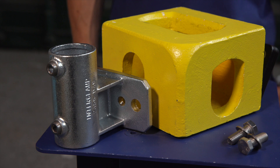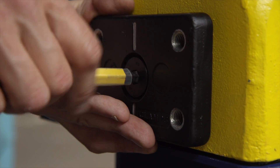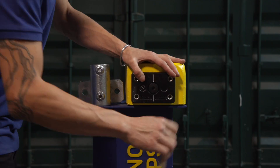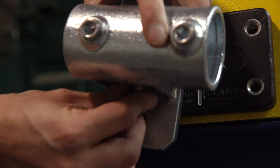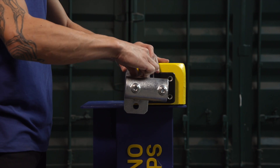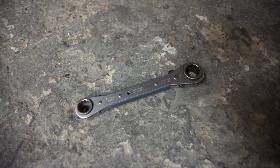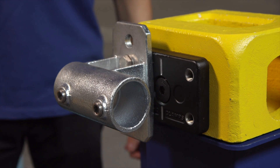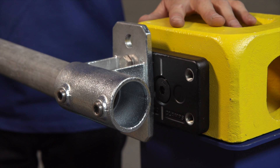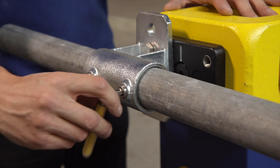So now that we've introduced you to our new horizontal parallel tube bolt-on, let's show you how it works. Let's start by putting a Domino Clamp into the hole of this corner casting, then screw the tube clamp to the Domino. You'll notice there's not a lot of room here for whatever tool you use for tightening, so you may find it best to do the first bit by hand. A ratchet spanner is the most effective way for doing these up at the end — I thoroughly recommend adding a quad spanner like this to your toolbox if you don't have one already. Once your tube clamp is firmly in place, all you need to do is feed through the tube and do up the two grub screws on the tube clamp.